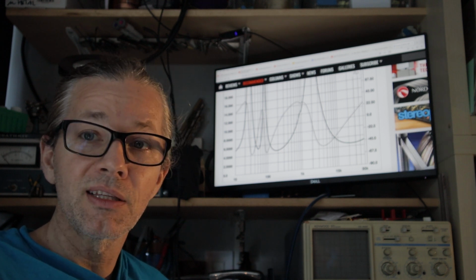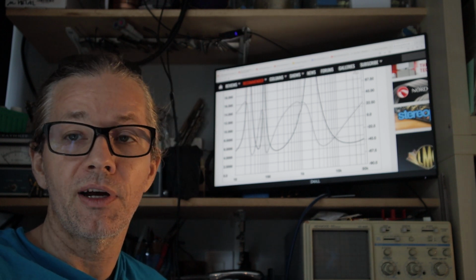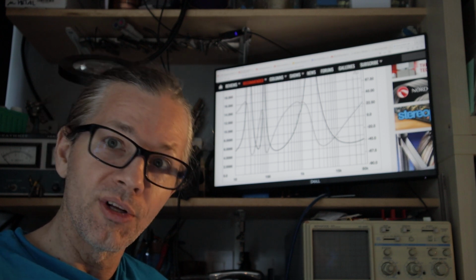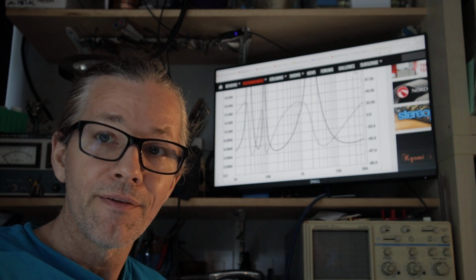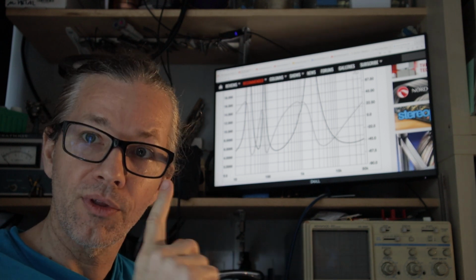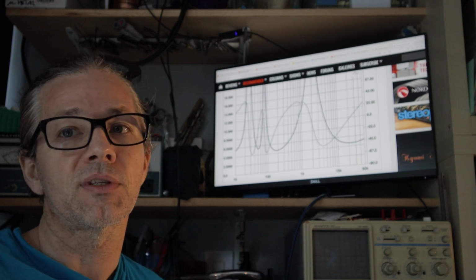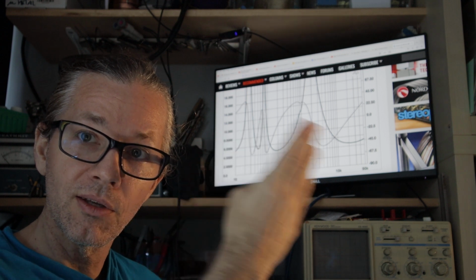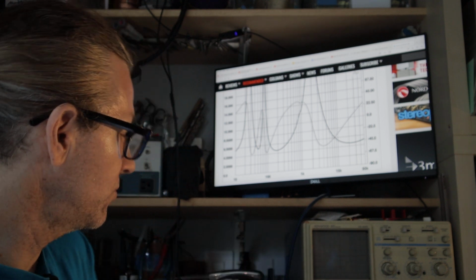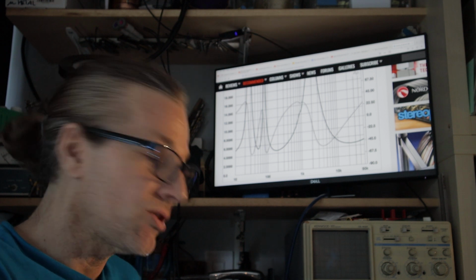Because when you are using that volt per meter, it tells you absolutely nothing about what sort of amplifier you need to look at, because amplifiers are not sold that way, okay, this amplifier puts out 15 volts or 200 volts. They are sold as 100 watt or 300 watt, 1000 watt, 2 watt. They are using watts to sell us the amplifiers. And now they started this volt scale to sell us the loudspeakers, and the two don't match, the two don't talk. So what happens when you have such a mismatch in the scales?